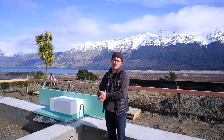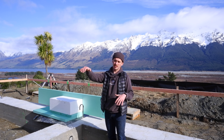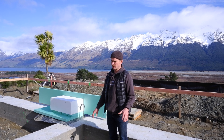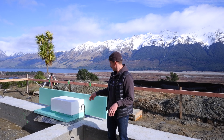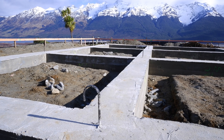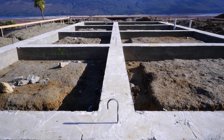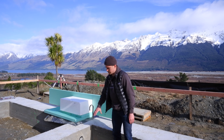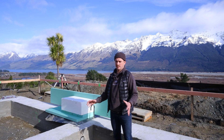This home is on a pretty old, 20-year-old building platform. Essentially what they did is carved out the hill and brought all that topsoil — bad fill — and just threw it over this edge. So it's on pretty bad ground out here. The foundation design has piles going all the way down into the good ground, the glacial till, holding up this portion of the house. Then these big concrete beams span between those piles.